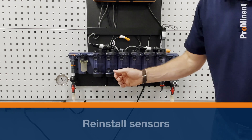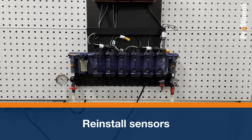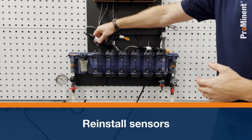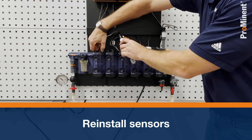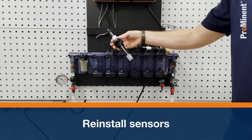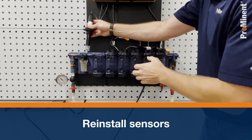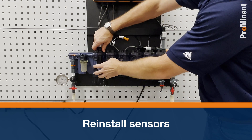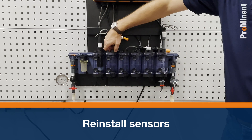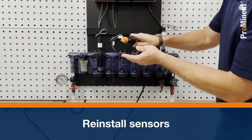I'm going to isolate the water by turning it off. First, I'll grab the free chlorine sensor, loosen the bayonet fitting, electrolyte the sensor, insert it, and clamp it in with the bayonet fitting. Next sensor is the total chlorine sensor — again electrolyte the sensor and tighten the bayonet fitting.